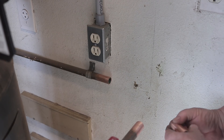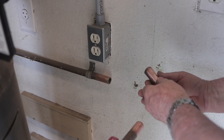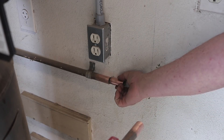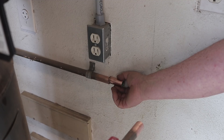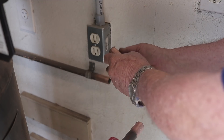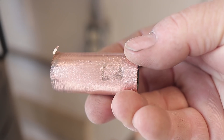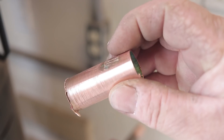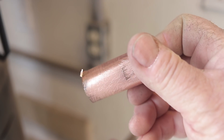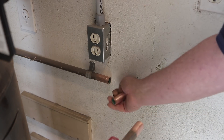A couple of things I want to point out before we go too much further. I'm starting to make my fit-up and get all the pieces in place. As I was cleaning the ends here, I found that the pipe was crimped there and out of round on the backside — and that's right where the fitting is going to need to go. So I ended up having to cut this back another couple more inches, cut this off, and now everything is perfectly smooth.